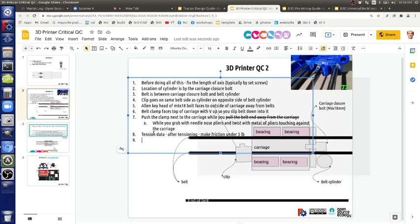And how do you know what's the least tension that you can have? How would you test for the least amount? I don't know. This is what I did: I tried moving from this side, left, right. If there was play, it was not tense enough. If you try to move here, you only get that feedback in one direction. You have to use the other side to test.